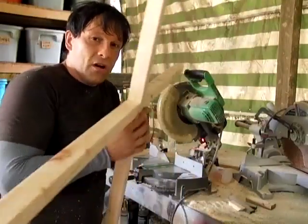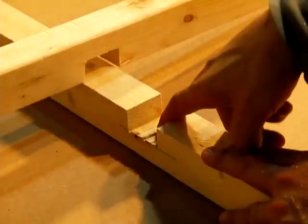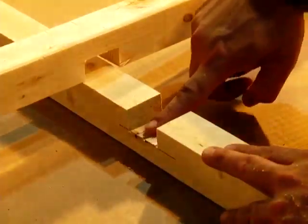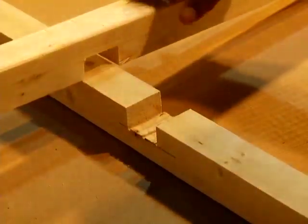This gives us our first set for the base of the arms on this. You're going to notice my curve is perfectly centered. You want to measure, make sure that your saw blade goes right down to where it curves right in the middle. You've got to know your saw to do that. It takes a little bit of scrap wood testing. I suggest you do that.